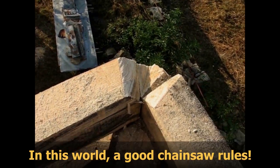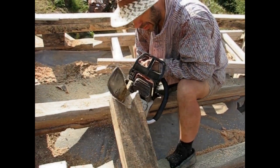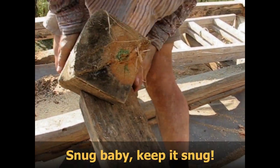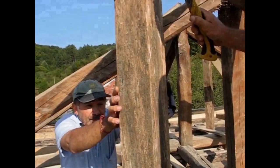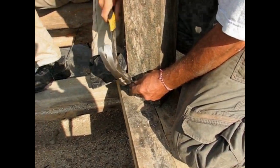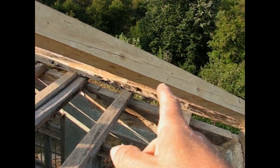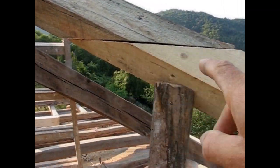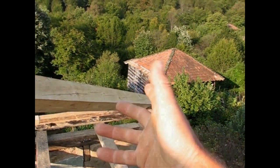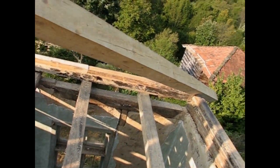There's a connection. Ready to go. And the top one's being made. TNT. Two hips put in place. 14x14 spruce is the dimensions of this material. It has a nice long scarf. The length from top to bottom is over 6 meters. These guys are 5, so we had to scarf them. I'm going to put another post over there. Take the load.